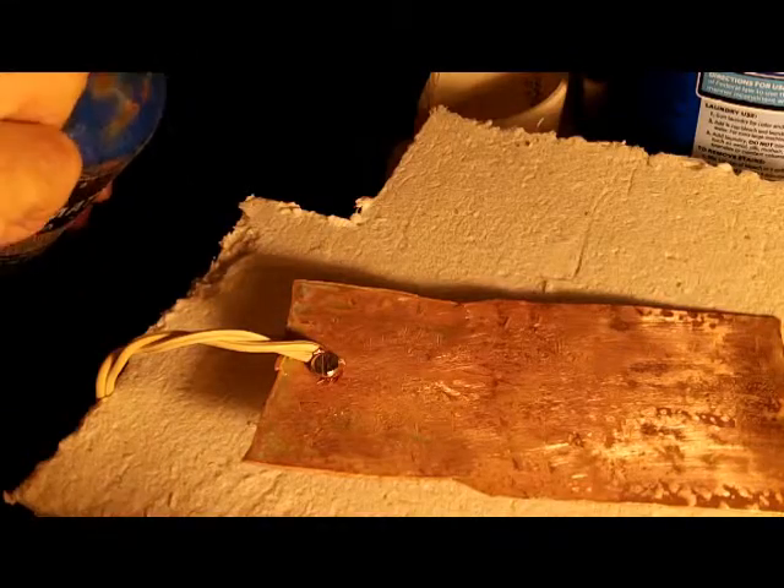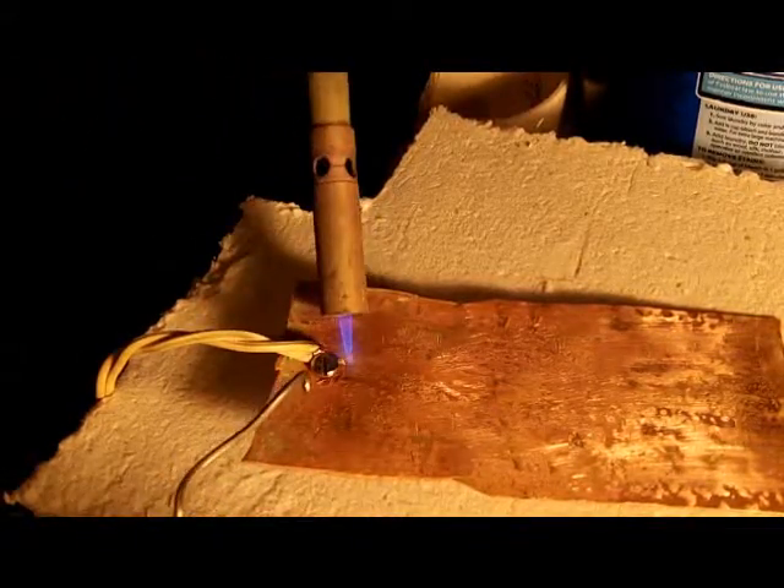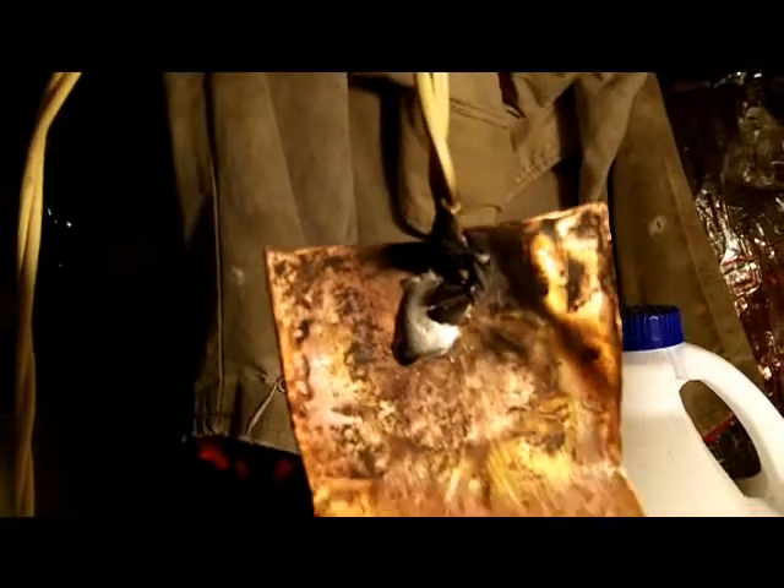It's just a little piece of copper pipe that I smashed flat with a hammer, then took a pair of wire cutters and cut one edge off. I hammered it flat again, opened it back up with pliers, and hammered it flat again so it's a nice flat plate of copper. Then I sanded it, punched a hole in it, put a screw in it, and put a wire on it. This is my cathode.